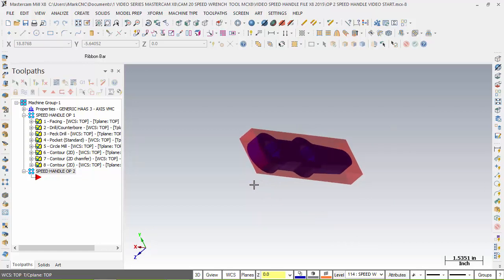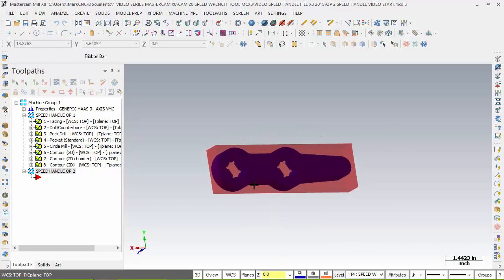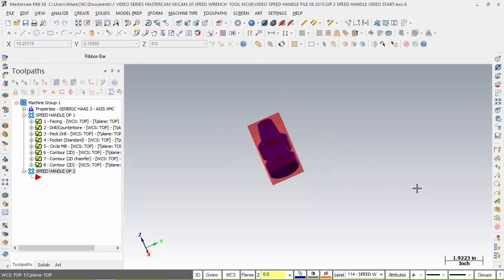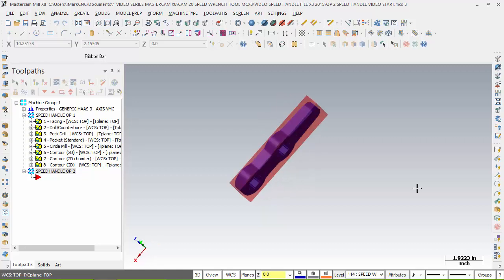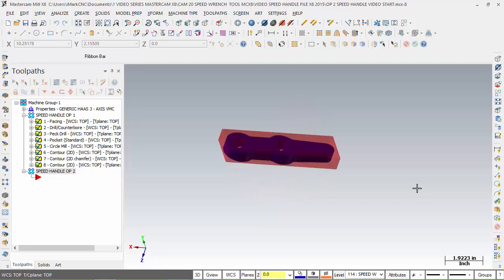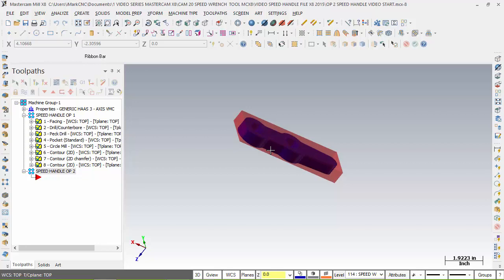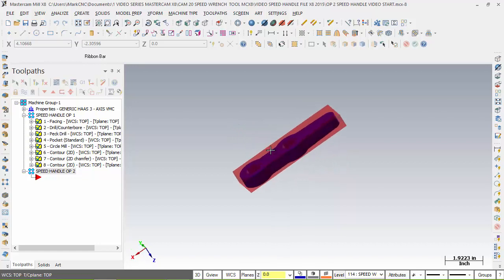And a good way to do that, I'm using a 3D mouse right now to rotate it around. If you don't have a 3D mouse, a little secret here, you can hold down Alt and hit your cursor arrows to flip it over to where you want it to give you an idea. It's probably the easiest way that beginners can use, or you can use your middle mouse button to spin it around as well. See how that works? The middle mouse button. Sometimes a lot of beginners can use the Alt key, holding it down while you touch the cursor keys and play with it till you get it to where you want it. So I'm just going to get it set up to where I want it. That looks good. I'm going to set up my WCS now. So let's go ahead and continue with that.